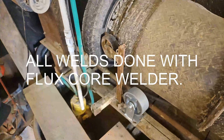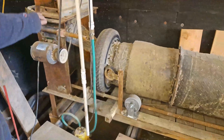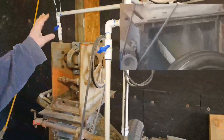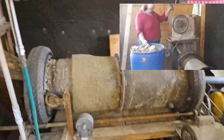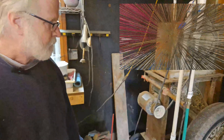Future projects: we put a jaw crusher up on top and run them both at the same time. As fast as we can feed the jaw crusher, it feeds the ball mill, so our feeding is very simple, very basic. Water needs to go through the entire time — the water washes out the sand and small particles.